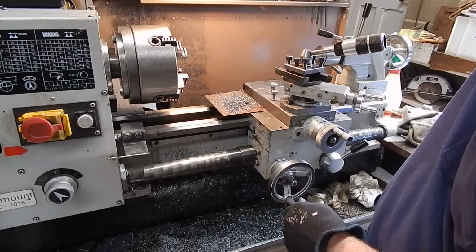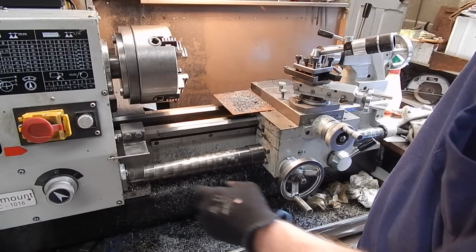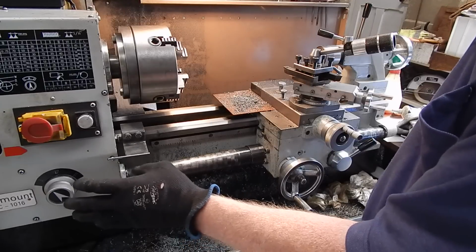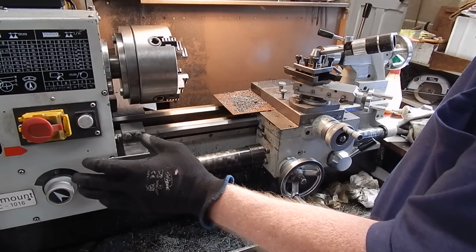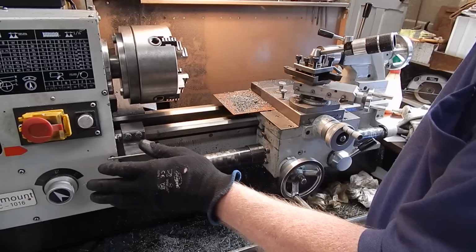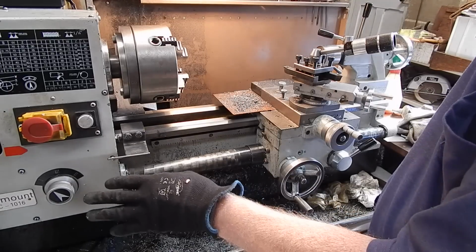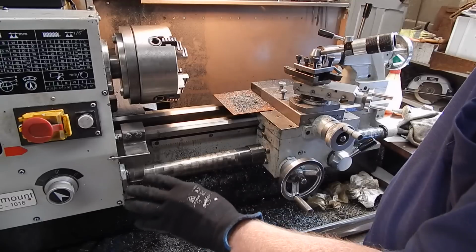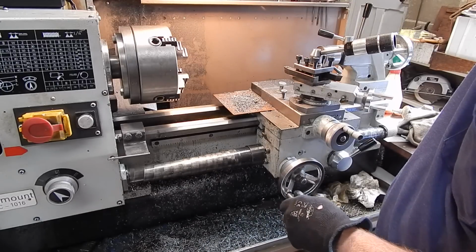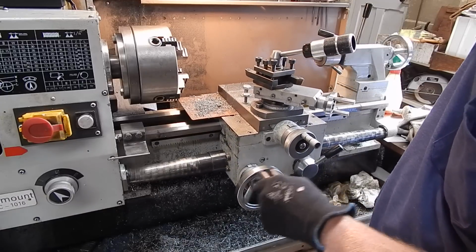You usually just put another lead screw shear pin in, or a bit of bronze or brazing rod or something, it's all overused. But if you've got a lathe with consumable gears in the gear train, if you're going to be shearing off teeth on those consumable gears, you're not going to be too happy. So something to think about. They're great in every other way, but that is the one downside.